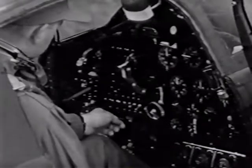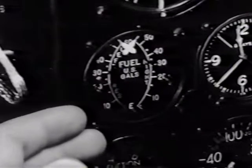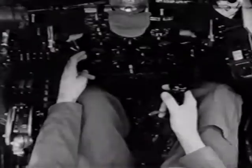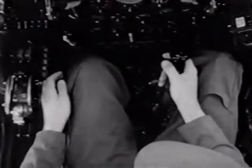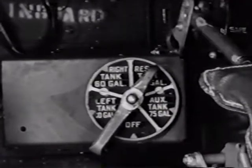When you turned on the battery, it energized the fuel transmitter. Remember always to check the fuel in your tanks. Down on your left is a fuel selector valve which makes it possible to draw fuel from 4 lines, 3 actual tanks. For takeoff and landing, always use the reserve tank, which is part of the left wing tank.